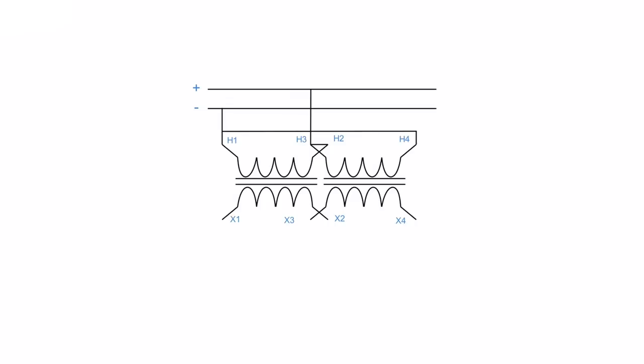Now let's look again at what happens when we have a bad parallel connection. So we have this happening where a current comes down and it heads this way and up and out, and then at the same time can head back this way, up and out. So let's take a look at our current flow. It's flowing this way, and then it's flowing back that way. That looks familiar, doesn't it? We have bucking flux happening again, which gives us what?